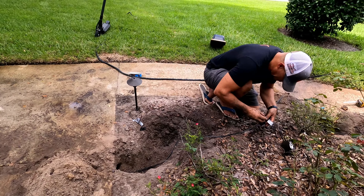The more trench you have, the flatter you'll be able to lay this in. If you angle it down even slightly — especially on a long driveway — it will be much deeper on the other end, and you could have to dig really deep to find it. I highly suggest a CAT plastic excavator for all your trenching needs — that is critical. Young padawan Kade is going to demonstrate: if you angle it down like that, where do you think we're going to end up on the other side? About that deep. I'd prefer we end up in the trench, so keep it level.